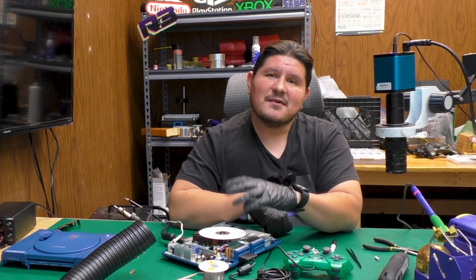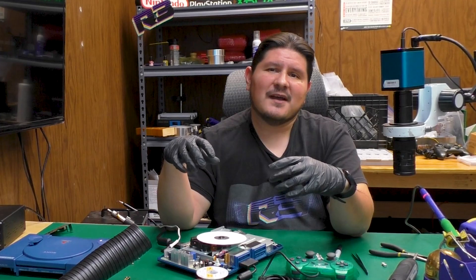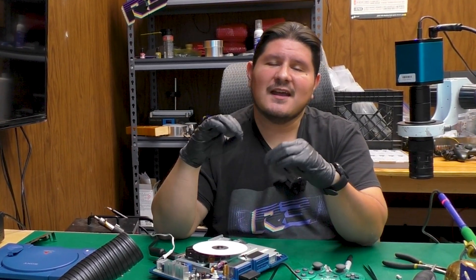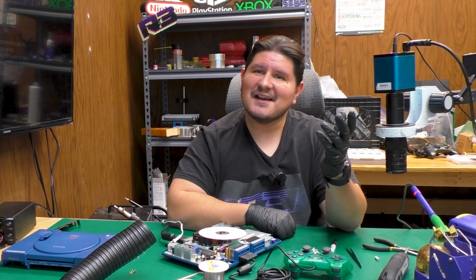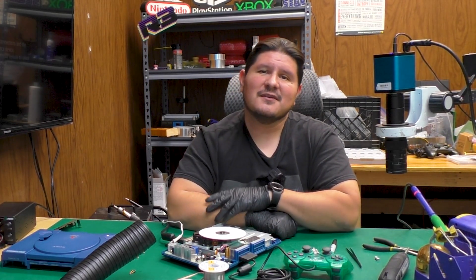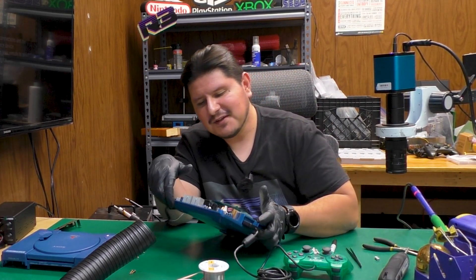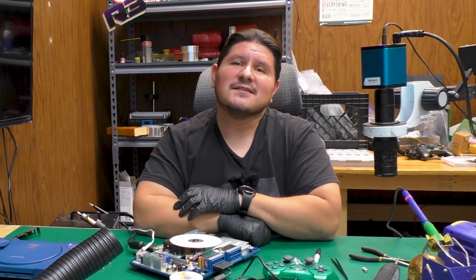Well, that's good enough for me. So I replaced all the capacitors on the motherboard — I'd say it was probably like a two-hour ordeal. It's mostly the time you have to take because the capacitors are in such a confined space, so you have to be very meticulous, and of course you don't want to have any bridging. Hopefully no one ever sends me one of these PlayStations to work on because it's not going to be fun and it's not going to be cheap. As you've just seen, the PlayStation works just fine — I'd say we had a successful capacitor replacement on the motherboard for this PlayStation debugging console, the PU-8. If you found this video helpful or useful, please remember to leave us a like and subscribe. Thanks for watching, until next time.